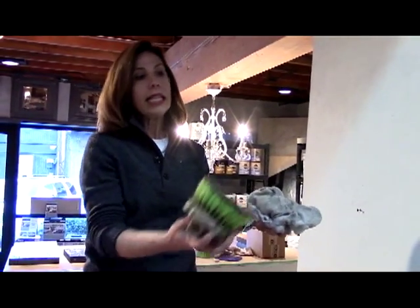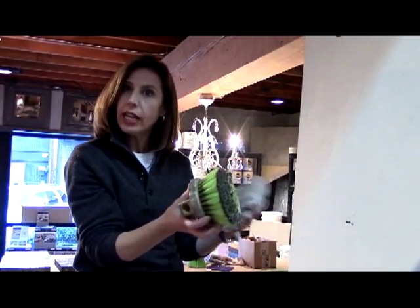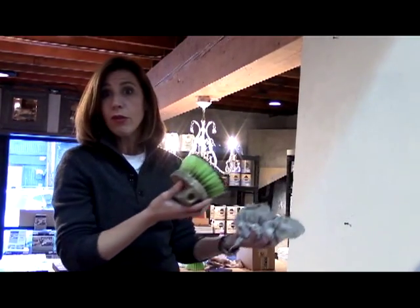One of the tricks in the glazing is to drag the glaze out and then push it from that sort of vein that you create, so that you get the unevenness of the glaze which gives it kind of the movement and modeling that's always so desired in it.